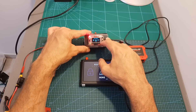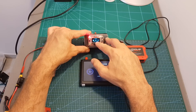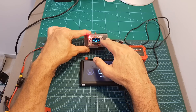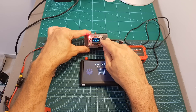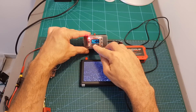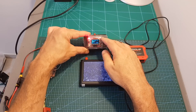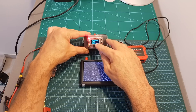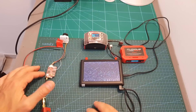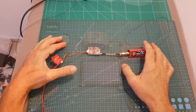After powering up the VTX, the scanner found the best signal on channel A8, then after turning it off the line went flat again. You can see it on the small screen of the receiver. You can exit the band scanner mode by pressing up or down, or pause the scan. In settings mode you can restore default settings, adjust the OSD layout, and exit the main menu. On the receiver screen you can see the current channel, RSSI, call sign, temperature, and battery voltage.